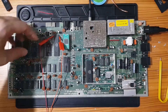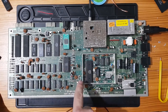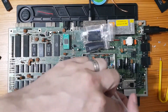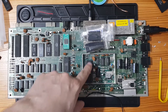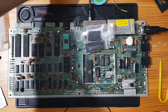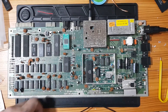So we've managed to get it from black screen to working — we know the VIC is the problem, so I'll have to order a replacement VIC chip. In the meantime, I've got some silicone paste, a couple of long heat sinks, a couple of small heat sinks, and some alcohol wipes. I'm going to clean off the chips and apply heat sinks to the VIC, the SID, and the CPU since they all tend to heat up. The Plankton PLA replacement doesn't get hot so it may not need one. With heat sinks on, this machine should last a very long time once we get a proper replacement VIC in there.